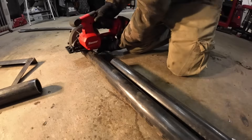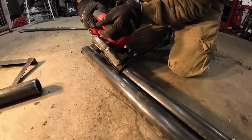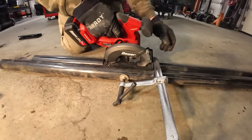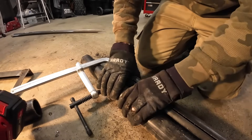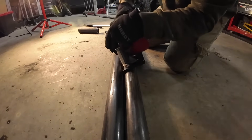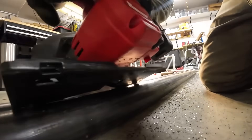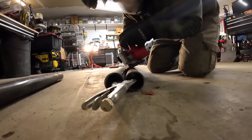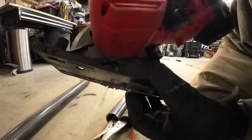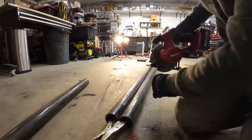I'm just a little bit worried that clamping it here might pinch my blade up in the curve. I'll shallow up the blade so I don't cut my clamp. I just need it sticking out just a little bit — sort of like that. Obviously the more blade I have inside the cut the straighter my saw is going to stay, but for this last bit I'll run it like this.